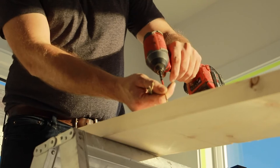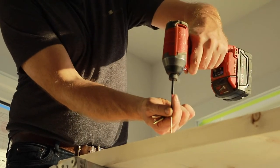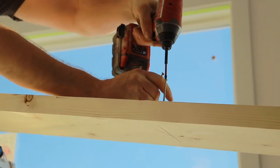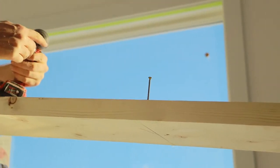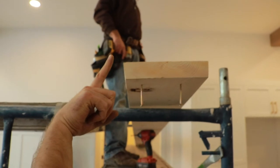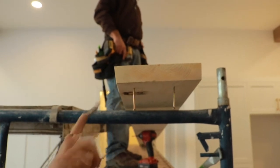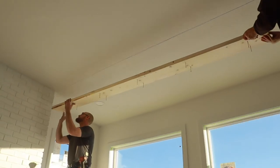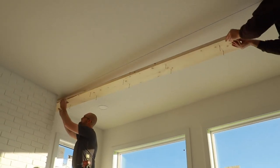Pre-install three-inch deck screws. Ensure your installation cleat is cut to the correct length and either has a slight taper or a one-eighth inch spacing for ease of the box beam install. Securely fasten into framing or backing material that is behind the drywall.